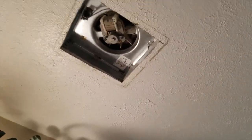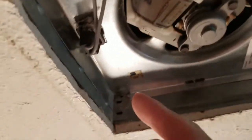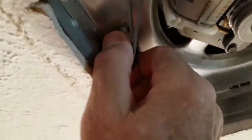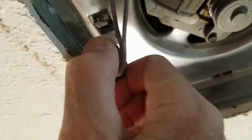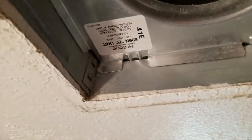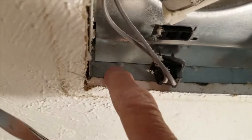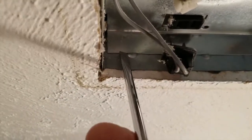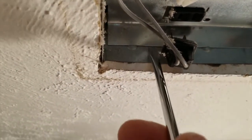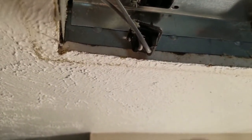So now it's really clean and there's a couple of things you can do beyond this. Here's the power cord. You can just wiggle that back and forth usually and it'll come right out. And then you can see sometimes there's little tabs that you just have to pull in to pull this down. You can see there's some little nubs here and here and here — you just need to get a really thin screwdriver and pull it out.